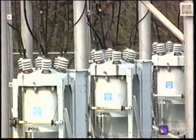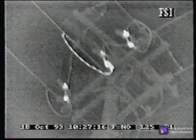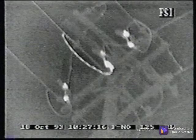Transformers and capacitor banks are naturally warm. On these, the presence of cold spots could indicate an anomaly. All wires should be at or near ambient temperature with no more than a 3 degrees centigrade rise. Wires warmer than that could indicate an undersized wire or an overload condition. Remember that here too, wires that have a barber pole striping or candy striping indicate some broken strands with the unbroken wires carrying the total load.